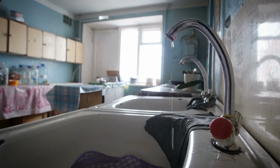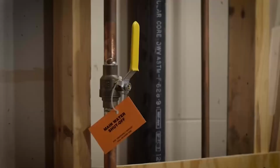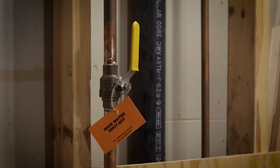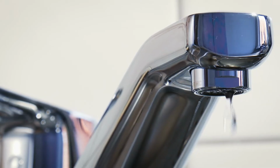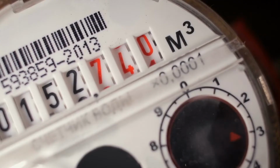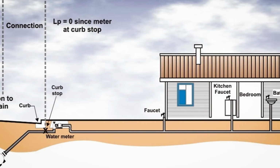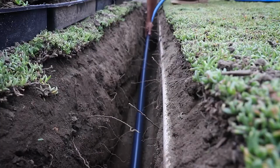If the leak is on your side, you can isolate different sections of your home to find the leak. Make sure you turn the customer shutoff back on and then turn off the water at the main supply valve into the house. Check the water meter. If the meter stops, then the leak is inside the building or at a hose spigot. If the meter continues to run, the leak is in the service line between the meter and the building. This is the responsibility of the property owner to fix.